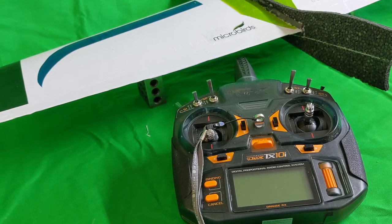Hi guys. I'm going to set up elevons on this flying wing. After trying and failing, I looked around the internet and didn't find any approaches other than 'keep swapping things until it works.' In this video I want to suggest a logical procedure to easily set up your wing or V-tail plane. I have a six-channel Lemon receiver in this plane, but all we're controlling are the elevons — ailerons and elevators mixed together. The radio has a standard program for elevons using channel one and two, set up with a 50% mix on both channels. The final output of channel one equals channel one plus channel two, and the output of channel two equals channel two minus channel one.